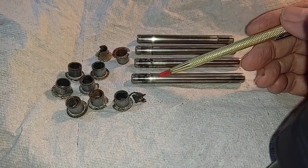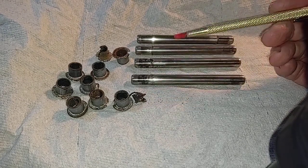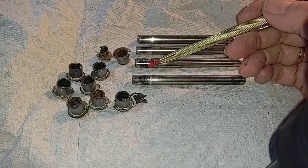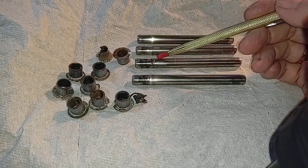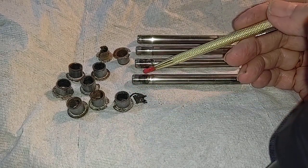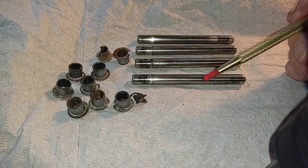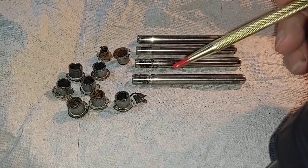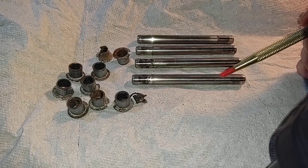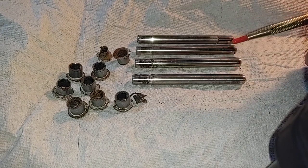The pins, as you can see, are stainless steel. These are at least 10 to 15 years old and they look great. But if you look right here, you see the black areas — all that black is the plastic that is transferred out of these bushings and onto the rod. The net result is, since the drive motors are torque limited, eventually you're sliding plastic over plastic. It says that's too much and stops moving. You can spray some lube in there and it might move a little bit, but still it's just not going to work.